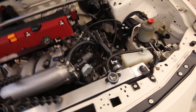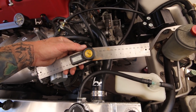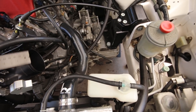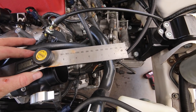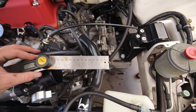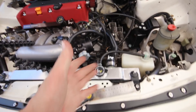Other than trial and error, the best method is using an angle finder or protractor to figure out where I need the pipe to go. In this case I want to shoot over the hose and come straight toward the reservoir. Right now we're at about 20 degrees, and as you can see that's more or less perfect as to where we need to go.